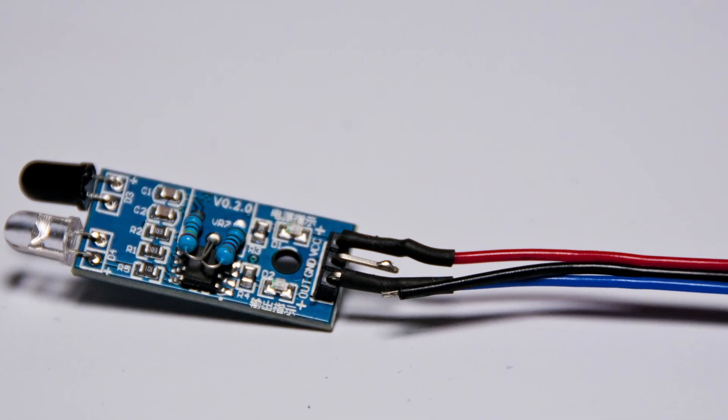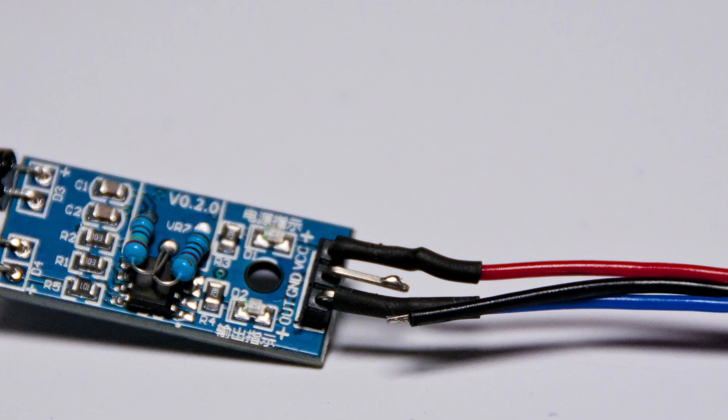After opening the Domino Robot box and spreading the parts out, I noticed that one of my electronics was actually broken — it was missing the heat shrink and the solder joint had popped off; it was not connected. This is a problem because it's the core aspect of the build — the IR sensor — meaning it won't be able to track the line. It will follow one side, but not the other.